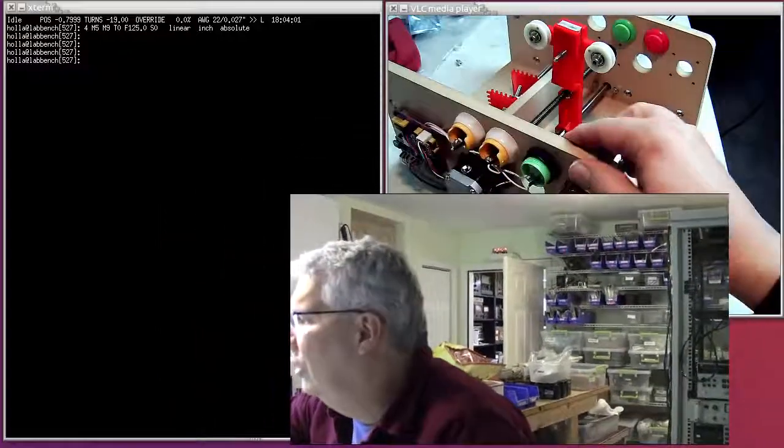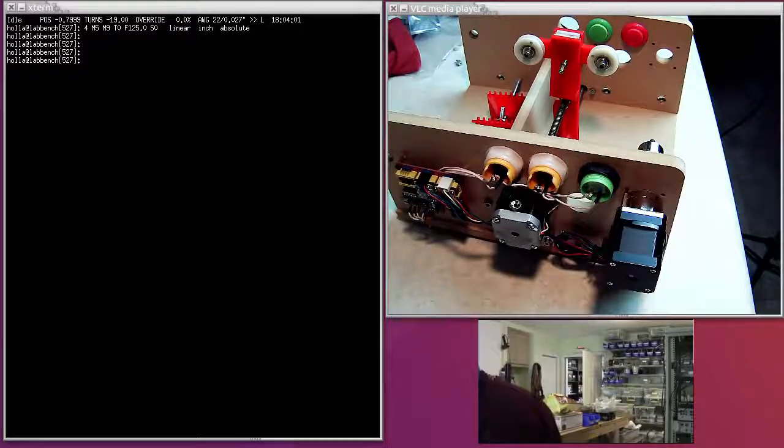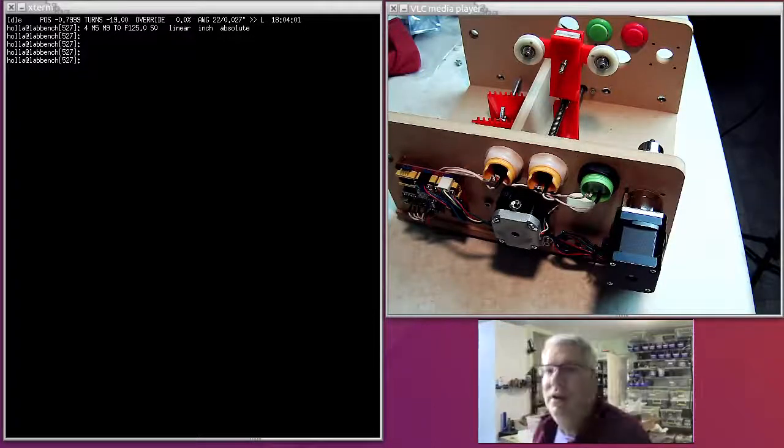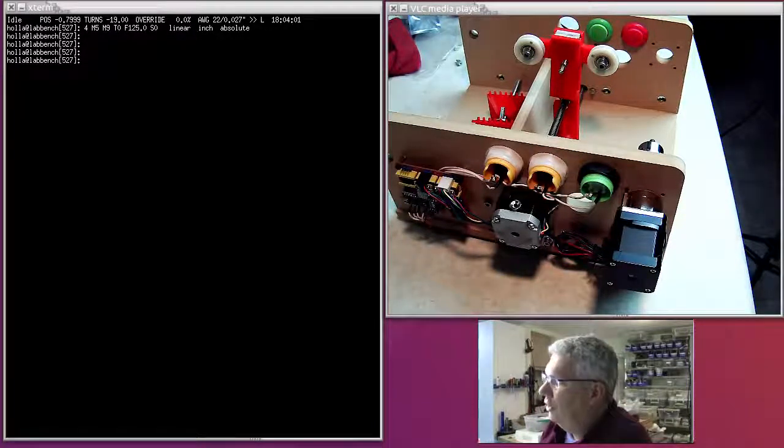The first thing I want to show you is I've put a geared stepper motor on the spindle. The reason I did that was the stepper motor I had there was a regular NEMA 17 and had no holding torque. On the GRBL board, when you're not driving the motors it disables the driver, so the motor is free to spin — that causes trouble keeping turns correct. This one has a lot of torque, runs sufficiently fast, and I'll be able to easily wind 16 or 14 gauge wire onto a spool.